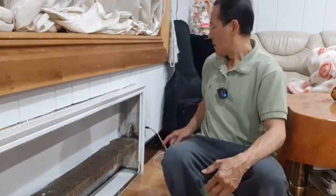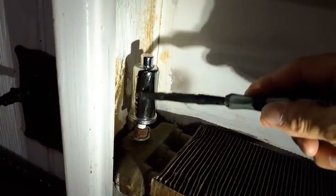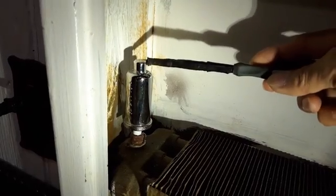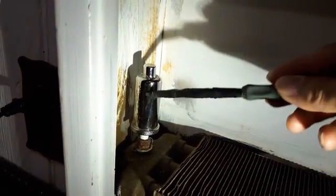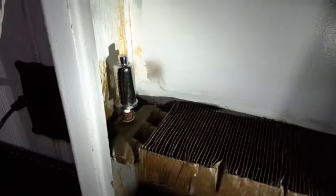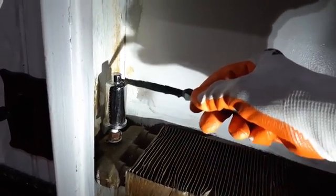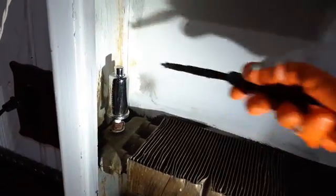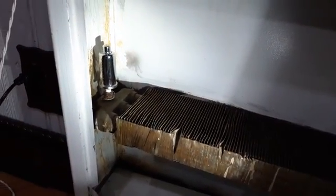Nobody wants this kind of noise. Let me show you why the vent valve has a problem — so much steam coming out here. You can see so much water coming from the body of the vent valve, and steam from the nozzle in the back. This is defective. With a gas steam system it's not supposed to spit out continuously like this — it should release for a few seconds and stop. This one is continuously leaking from the nozzle in the back — that's no good.